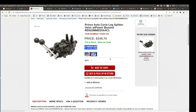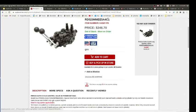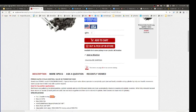The cylinder valve, this one says cylinder, means that back in neutral position, it locks. So that would dead stop. It wouldn't work for that application. For a cylinder, since a cylinder dead stops, that's fine, without much inertia typically.